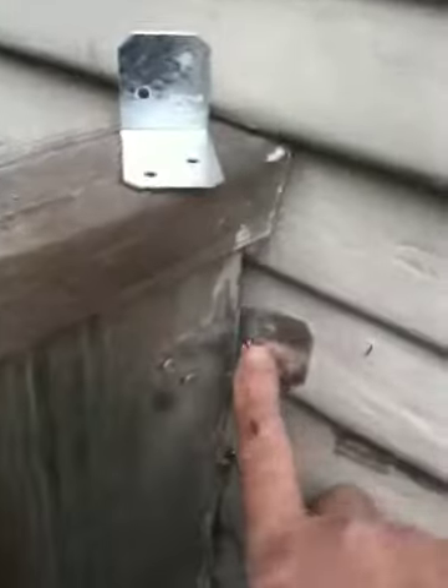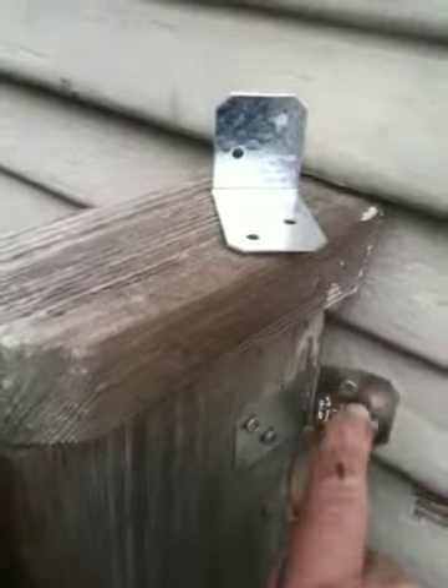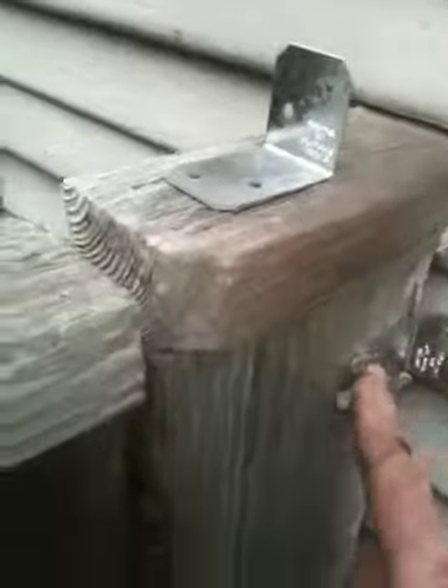Here's where I repaired the saggy gate, and how I did that was by drawing this into the wall. I put it on out here and I put long screws in it — that's a piece like that. Also at the bottom, this was all sagging down, so I pulled it out and I put a shim in behind that post type thing. I also put a corner brace up here to take the sag out of the gate.